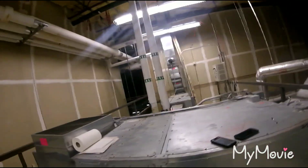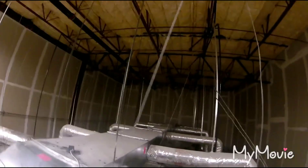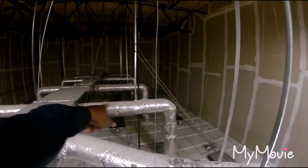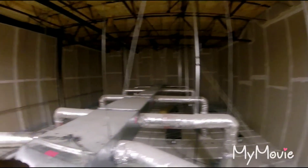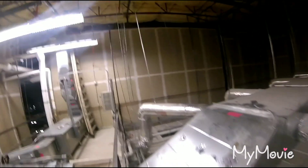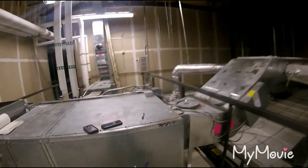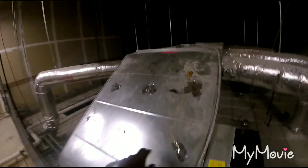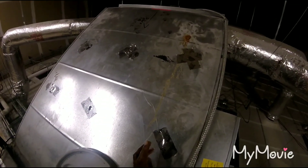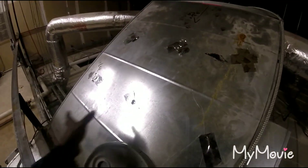Just to give you an idea of what I was talking about — this is your air handling unit right here. One supply had 250, one was 150, 150, 150, and I think another one was 180, same on the other side. It should all add up to 1750. Your filters go in at the return side, and here's your supply with the blower motor inside. If you do a duct traverse right here, it should add up to 1750 supply coming out of the unit.